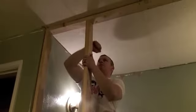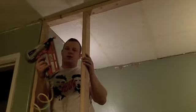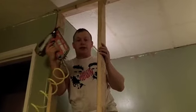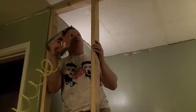You might notice that I am not using a framing nailer. This is actually a finishing nailer — it is shooting two and a half inch nails. That is because this is a superficial wall. Literally a curtain would have the same structural integrity necessary for this wall.